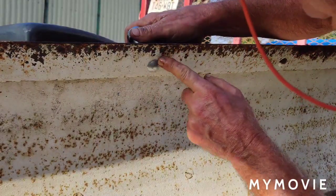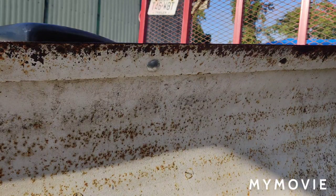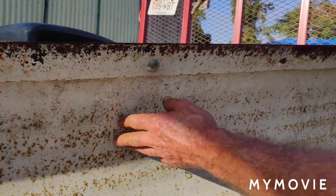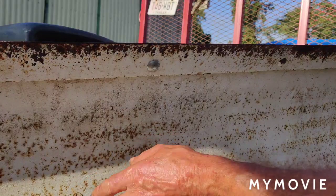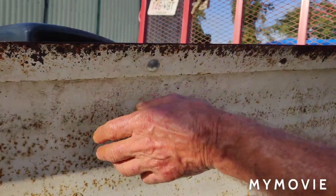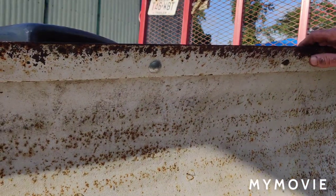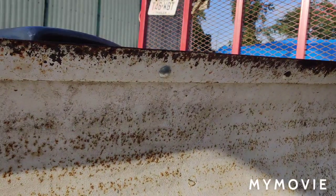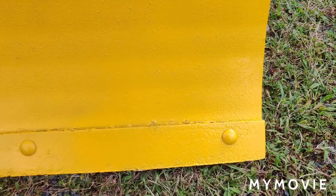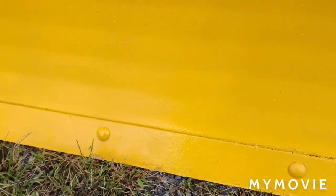Okay, it sucked right on — that's good, that's gonna work out. I'm just going to do the rest off camera. I'll take the wire brush and scuff everything up, then take my degreaser and wash the plow off, let it dry real good, and then we can paint it. It ended up working real good with the carriage bolts — I did all five.